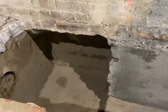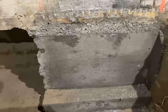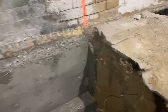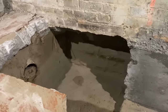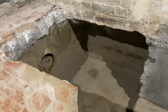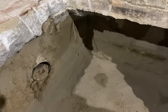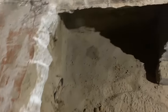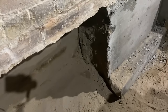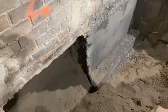Right beside section one, section two is dug out and ready for pour, and beside that section three still remains. So we've got section one now poured in concrete, the dirt from section three still intact, and only the section twos opened up. This is why the foundation remains very much intact — one section in concrete, one section open, and one section in dirt. On the left side it rests against the sand in section two, and on the right side we now have concrete to concrete, cleaned off so the new concrete will form against the other section.